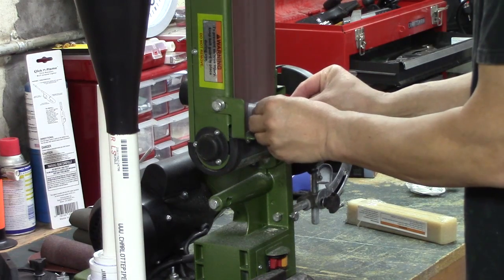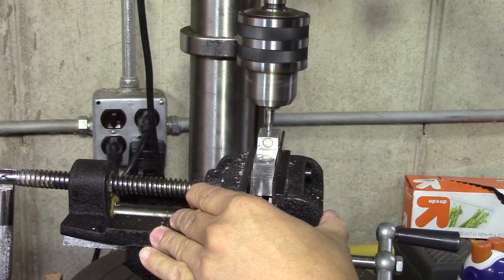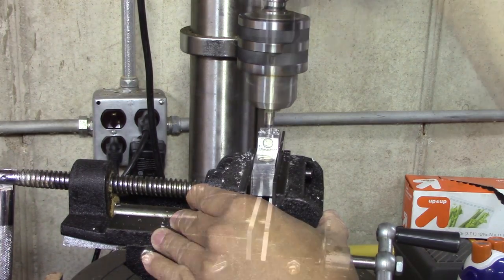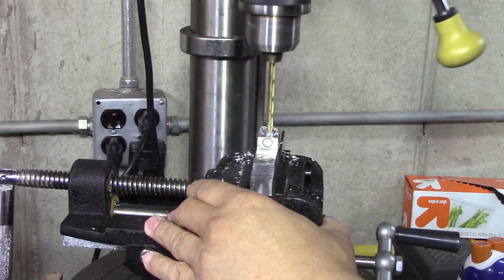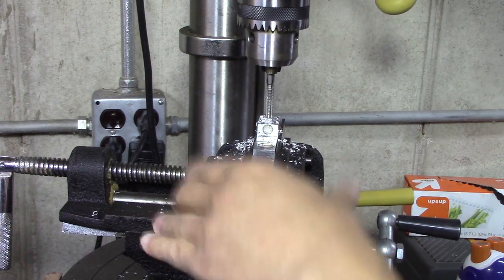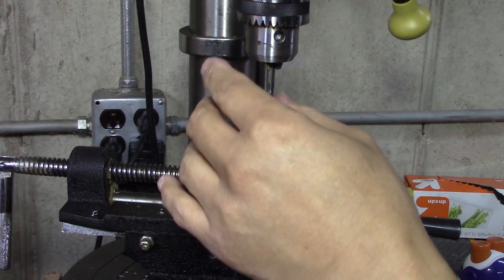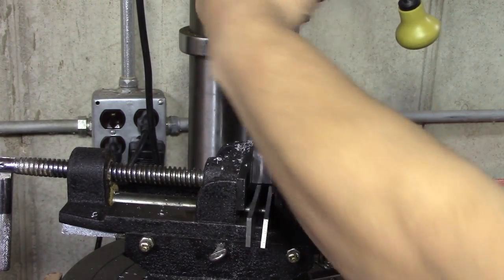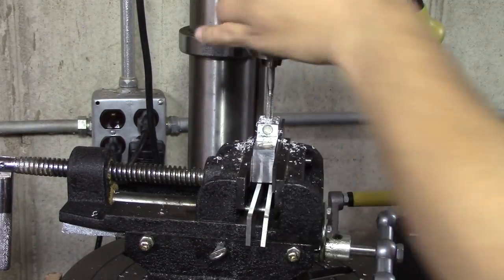I'm putting the cart before the horse here by taking out some tooling marks, but I wanted to see how it would look. I was going to use a slitting saw but I don't have one, so I decided to make a set screw instead of a slit to hold the dial indicator in place. I'm not power tapping this, but I get it started with power and then go by hand to get it deep in there, finishing with the tap.